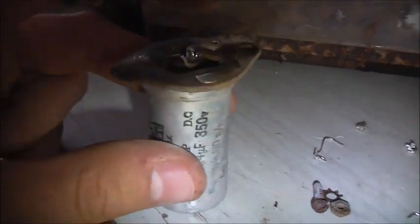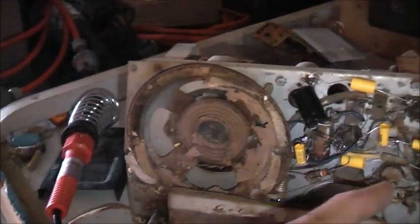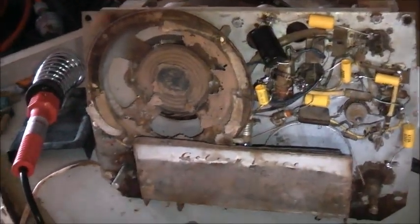I'll just unfold those tabs, pull this off, and then I can unseal this capacitor. If I can get one small enough, I could put a new one inside this and bolt it back on. It's an absolute nightmare though, because everything's in a tight spot. These would have been put on first, then everything else put on around them - the valve sockets and these went on the chassis first when they made this radio, which is why it's such a difficult spot when you want to restore them.